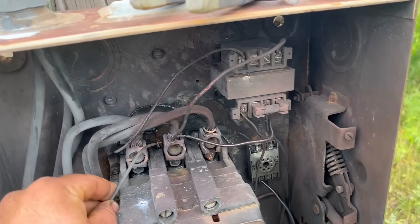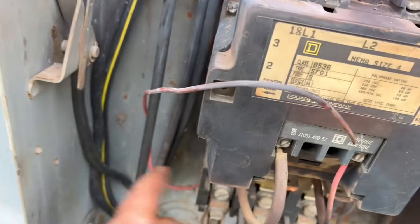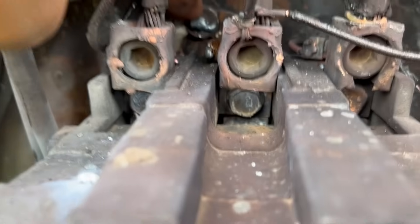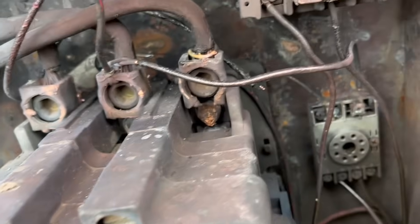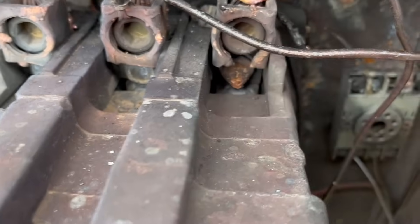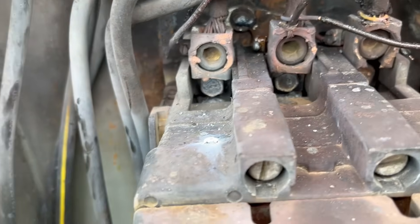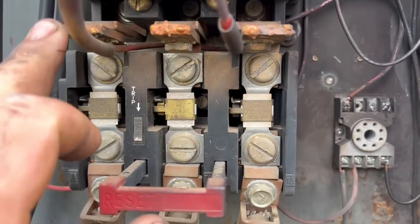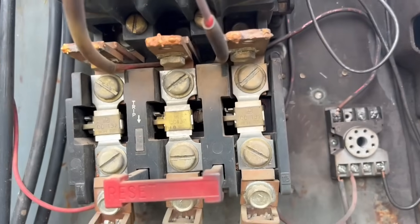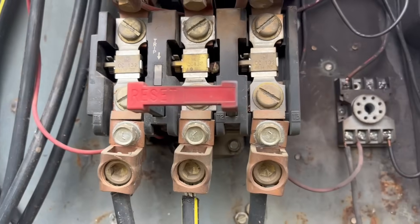This wire was back around here — I pulled it out. It's off that middle terminal. This goes down to the coil. It blew up. You can see it looks like it struck an arc from here to the back of the box. The box is grounded, and it looks like it had an arc struck. It actually has melted that brass bolt down in there. It struck an arc down in there somewhere. Probably better pull this apart and look it over. Down here, these must have drawn an arc between these three lugs. And there's some melted copper — must have popped pretty hard.